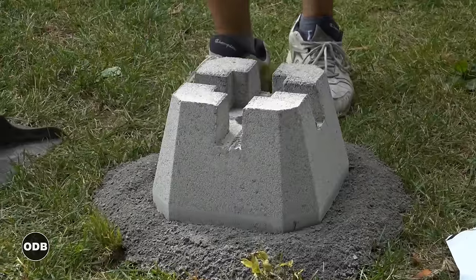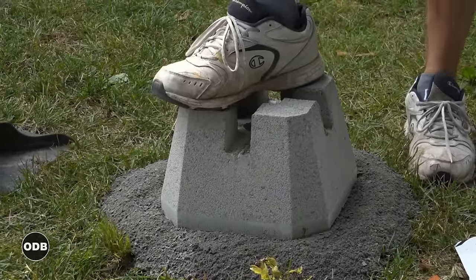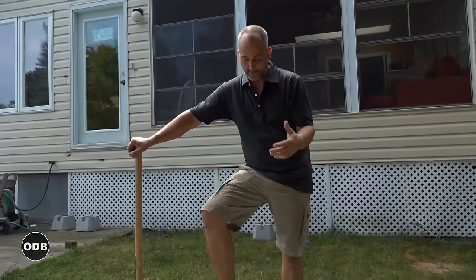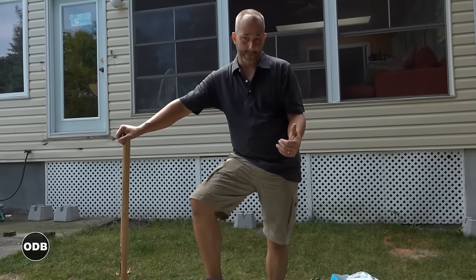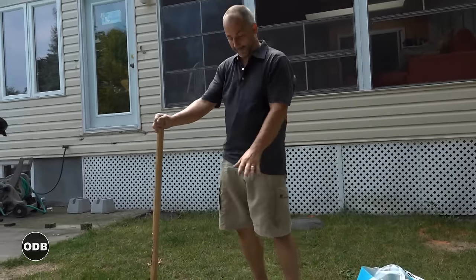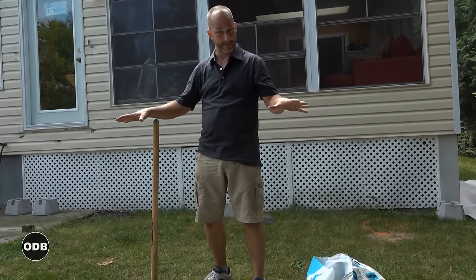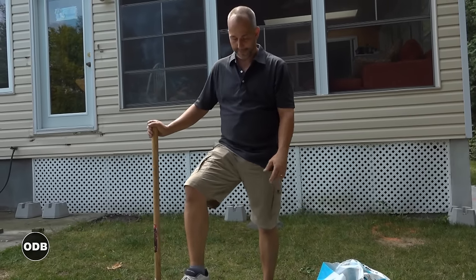When you're on clay, what we're really doing is creating a point load down to the clay ground. If we were to dig this out and fill the hole with gravel and then put our block on it, that hole would just be full of water every time it rained — it would actually encourage rot if our post got down into the ground. Doing it this way ensures that in the wintertime the whole deck will lift together and in the springtime the whole deck will settle together. We'll do every one of our posts exactly the same and we shouldn't have any issue.